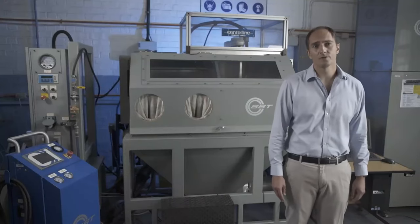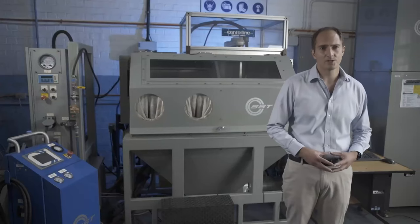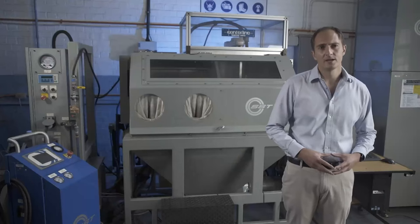There are two main types of cold spray machine: high pressure and low pressure cold spray. High pressure cold spray generally operates at around 50 bar and will be able to spray the majority of metals, including steel. One of the drawbacks is that the nozzles erode very quickly, and hence the process is expensive to run.